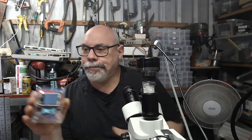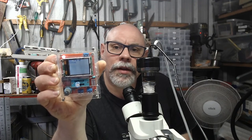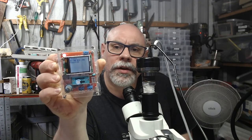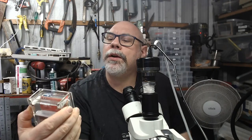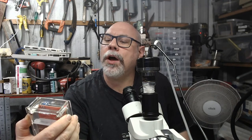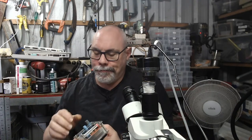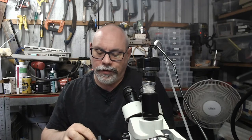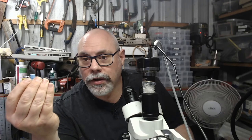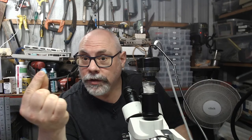All right, then you switch it on. And then he has a look and he says, testing. See, knows it's a capacitor. And then it's telling me that it is reading 464 microfarads with an ESR of 0.23 ohms, V loss of 1.4%. And this is a 470 microfarad capacitor. So for it to tell me it's 464, this one is still definitely functioning within spec.